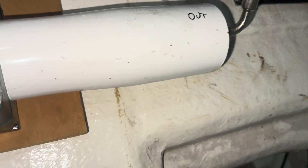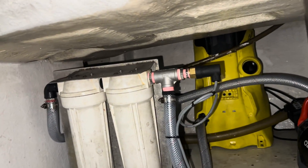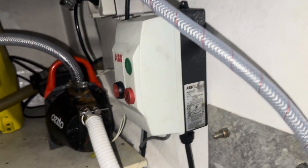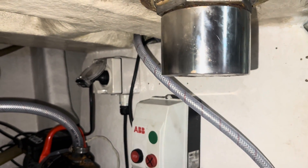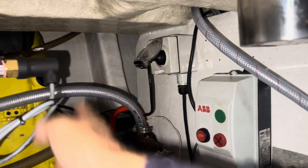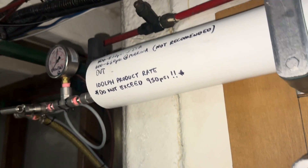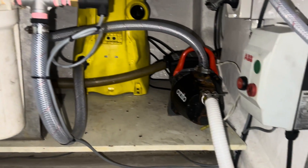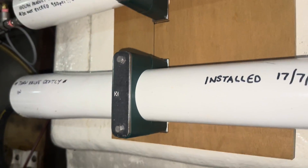With the membranes, the bits and pieces and so forth, you'd probably be under $2,000 Australian. The big killer is labour and fitting it off — like trying to find a location. I have made proper boxes before with HP, LP, overload protection, load pressure switching, the whole lot. You basically just push start, it kicks the boost pump in, when the pressure comes up it kicks the high pressure pump in and it runs through. You just have a manual valve there and a TDS meter on the end — when the TDS gets there it just actuates the solenoid. It's not hard to do, but you're generally trading time for money. At the end of the day you've just got to work out which is worth more: your time or your money.